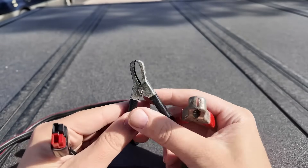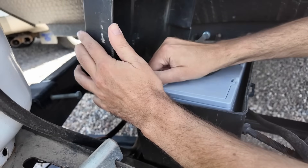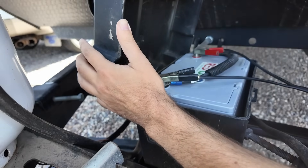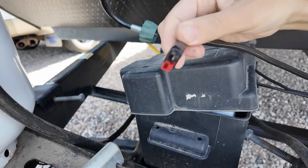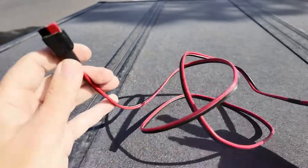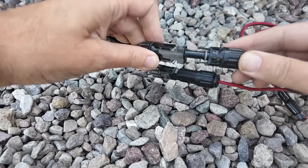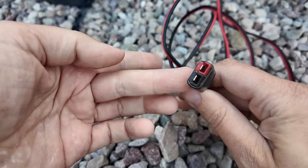If we're connecting to the battery side, I have a set of alligator clips that go to a set of power poles on one end. Red to red, black to black. We're safe on this end because there's no way to get those two connected without really shoving something in there. On the solar panel side of things we've got MC4 connectors, and I've got those adapted out to power poles so I can use them with my systems. It's nice and safe because you'd have to shove something pretty hard in there.